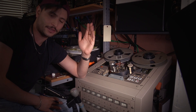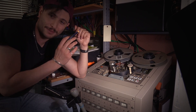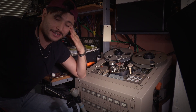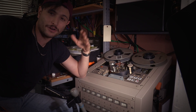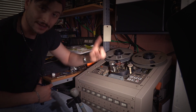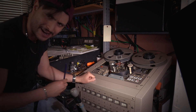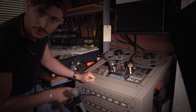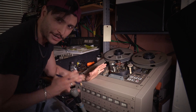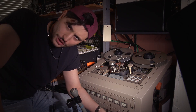On this machine there's actually no zenith adjustment, so I'm just hoping the china marker test shows a good, uniform wear pattern and I won't have to worry about it — hopefully the transport alignment I did takes care of whatever was out of whack. So we're doing two things: the angle at which the head contacts the tape, and the zenith — both of which are not the azimuth adjustment. The azimuth is done with a calibration tape and is much finer tuning than what we're doing here.